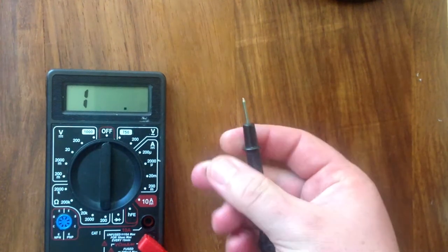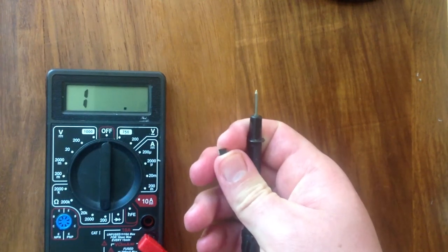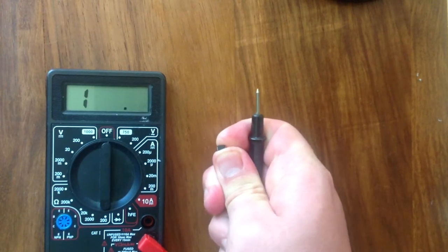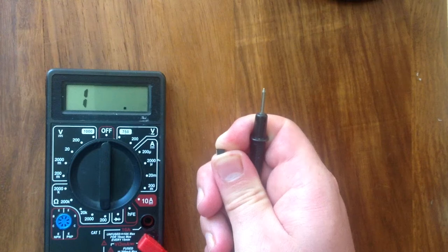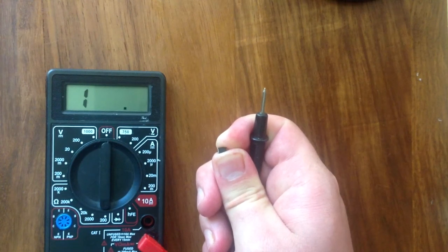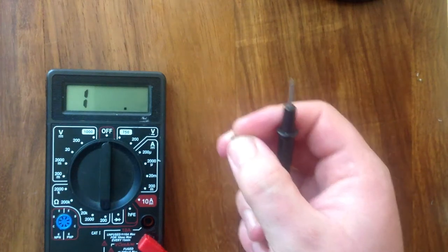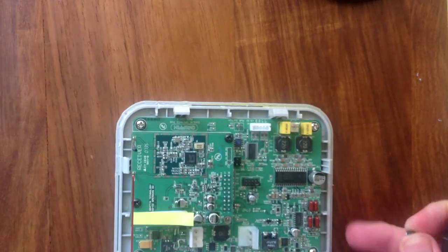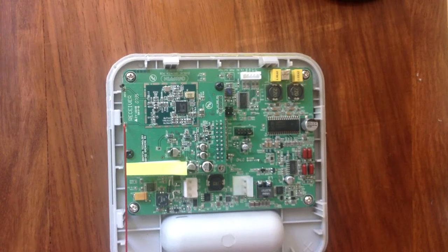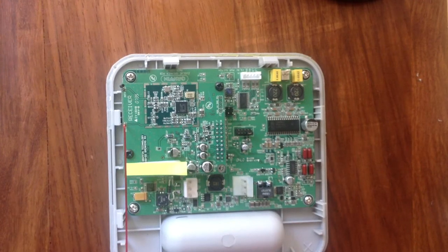I was unable to figure out what kind of diode it was. I looked at the serial number - it's hardly readable, it seems to have heated up somewhat and the white paint on it seems to have turned a brownish color - but I could tell it's made by ON Semiconductor. It seems to be a diode, so what I did was carefully remove it and I got a 1N4007 diode because that's what I had on hand and that diode is pretty much good for everything. I folded the legs very carefully and soldered it down onto the surface mount pads.